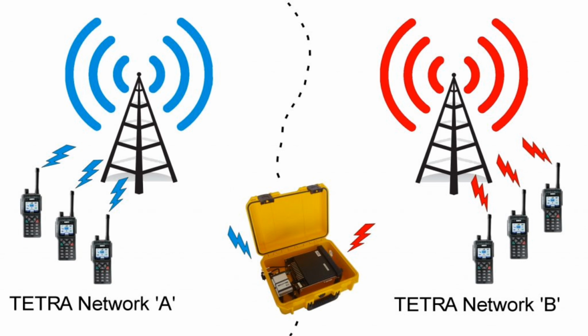Below -10 Celsius or above 40 Celsius, they recommend an optional solar shield to protect it. But what's really impressive is the IP66 rating. That means it's dust-tight and can handle powerful water jets. It's built tough. There's also a stark warning about hazardous voltages inside the power supply unit. Definitely not something for field repair. It needs professional servicing. Even specific rules for railways, like installing it at least 3 meters from the tracks, using shielded cables, it all points to building something incredibly resilient.